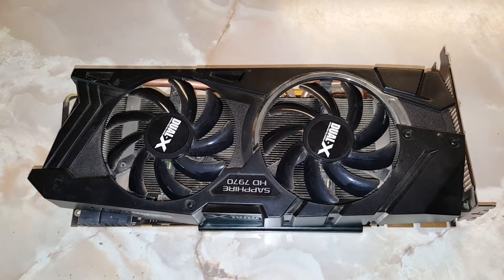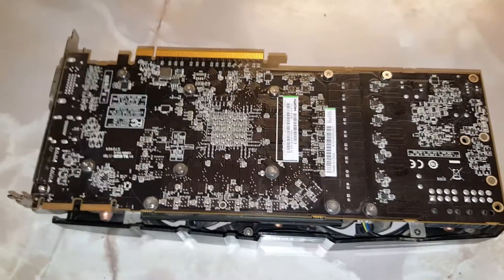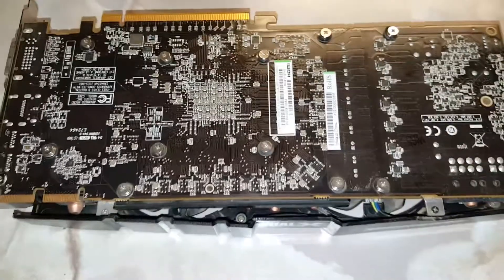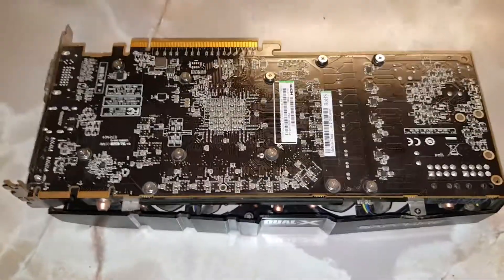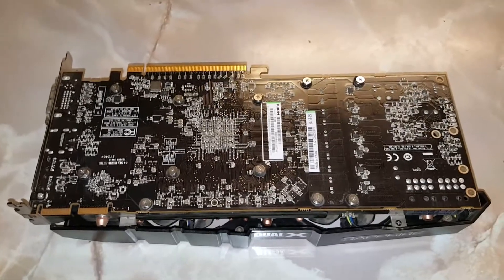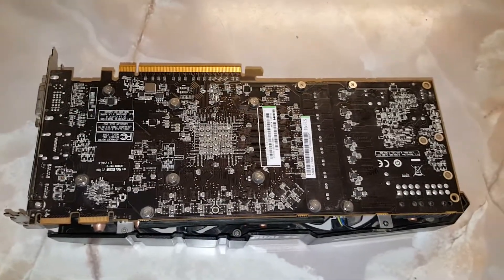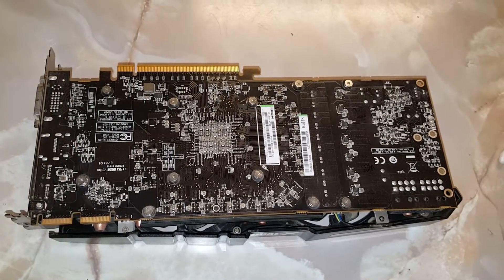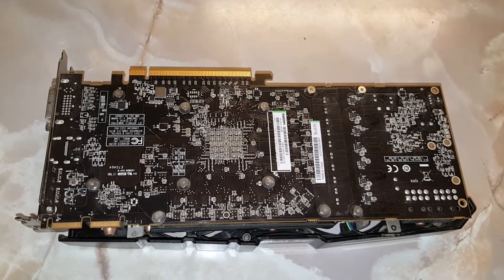I'm gonna bolt this thing all down, put the screws back in, then plug it into the computer and check out those temps to see what we brought it down to. This should hopefully prolong this card's life for a little while longer. I didn't let it bake too long, but I should have done this months ago. One thing I did want to note — make sure you don't crunch the screws down too tight. You don't want to put too much pressure on that die. Please be super gentle. It's really a very simple process — it's just a matter of getting the courage to open the thing up.